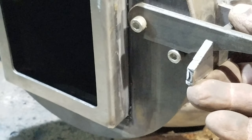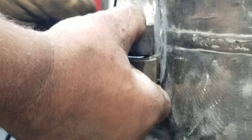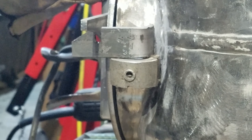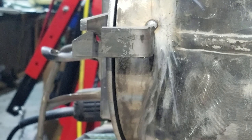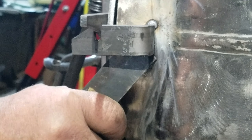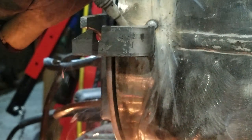A smack with a hammer, check that it fits, and I'm going to use a small magnet to hold it in place while I weld it. I use these magnets all over the place — I've got a real selection that I use for all sorts of different jobs. Always take the magnet off before completing the weld because magnets don't like excessive heat. Some slight adjustments just to get it perpendicular, then I'll fully weld it and give it a test.